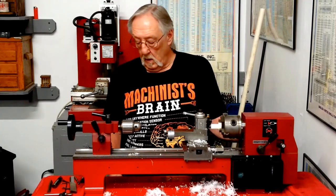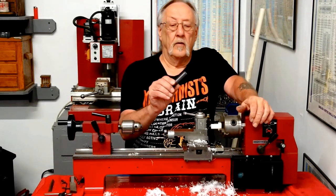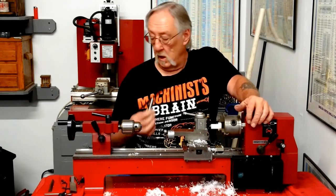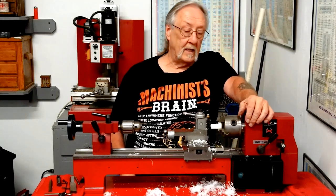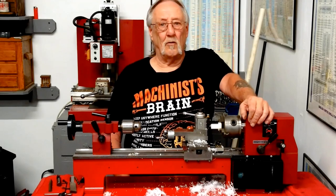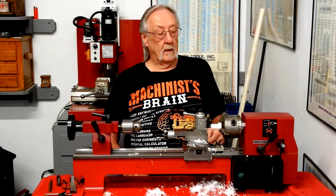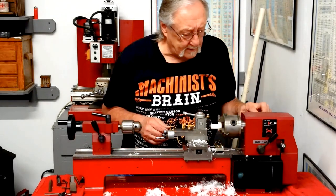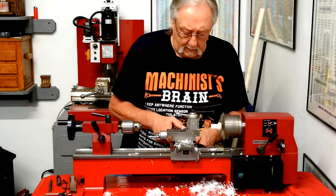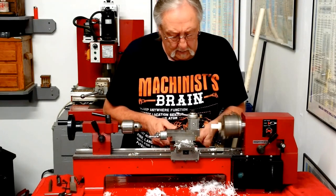Looks pretty good. That was 670. This is 625 and it slid in there nice and snug. So I'm going to make that, let's see, 670. If I take 60 thousandths, that will be 610. That should pass. Let's try to do this. Okay, 10, 20, 30, 40, 50, 60.